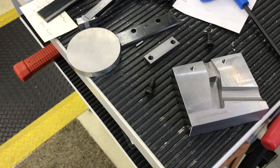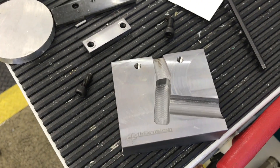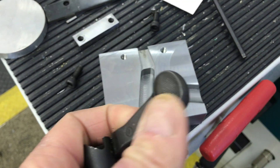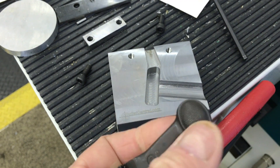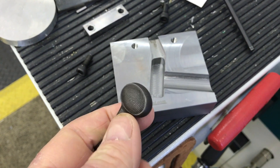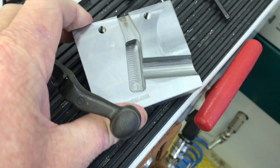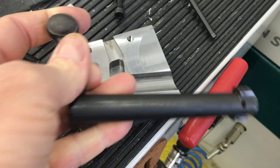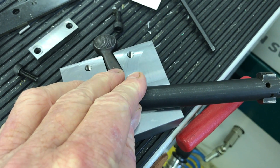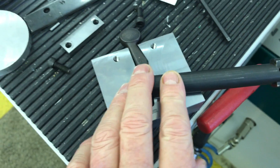This is a little project I've been working on. I made a bolt fixture to turn these bolt knobs down to a 5/16 shank and then thread it to 5/16-24. I made this in mild steel and I've done a couple of them and they work pretty good, so let me show you how this works quickly.